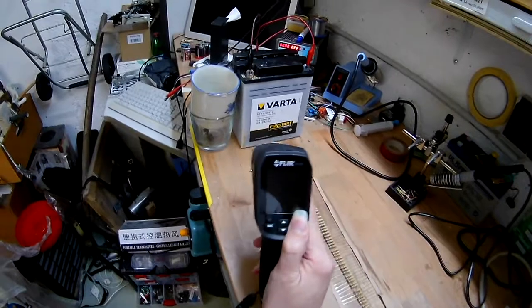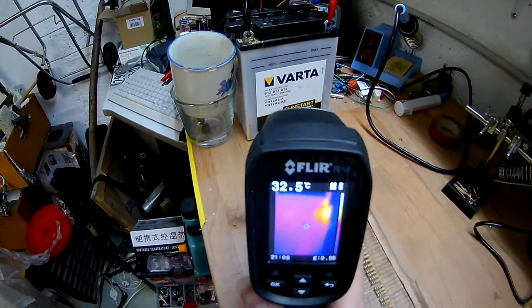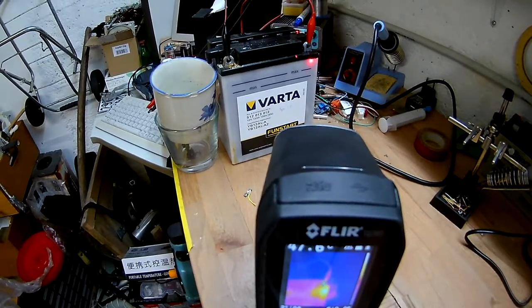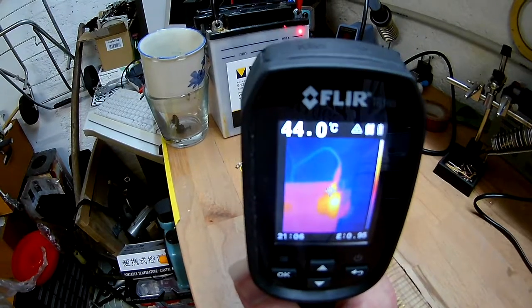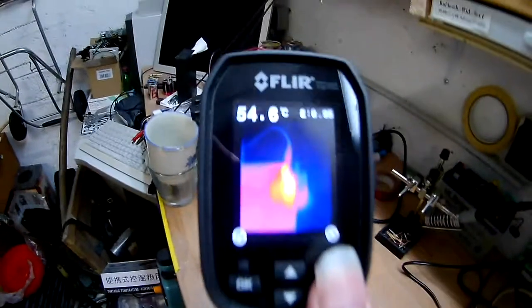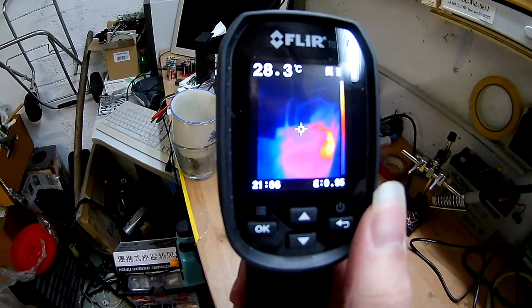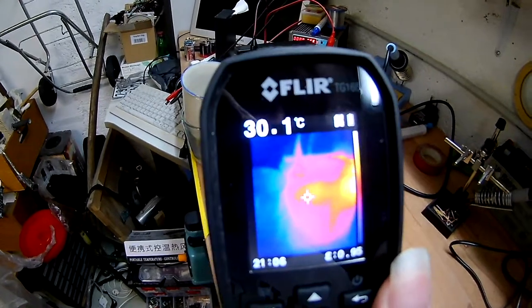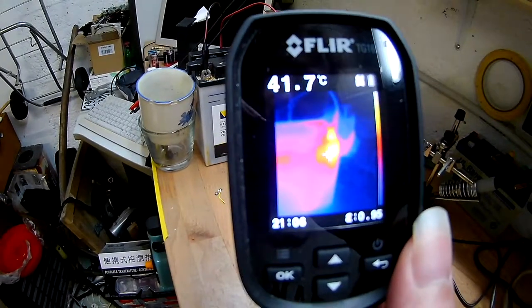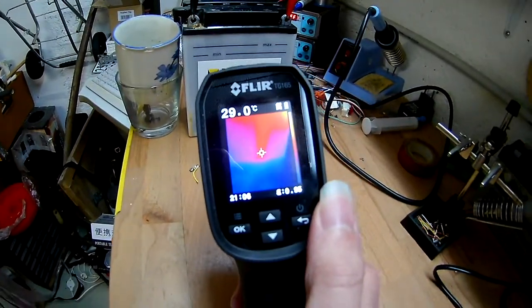This chamber was completely empty — nothing — so we put distilled water in there. And lo and behold, let's look at the thermal image of that switch on the camera. Yeah, you see that? That's like 55 degrees — that's quite bad. The rest of the battery is quite fine, around 34 degrees, but this thing is just cooking here, and strangely only the top, not the bottom. This cell here is cooking too.